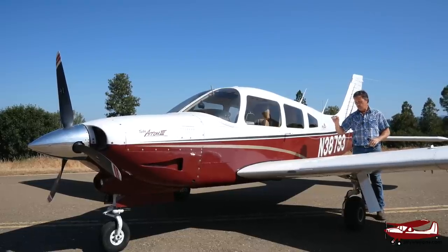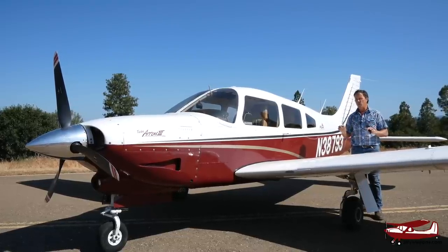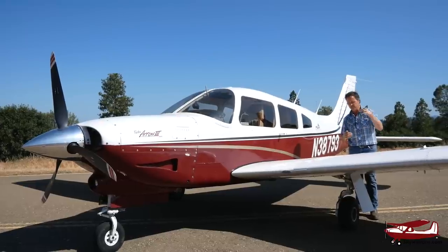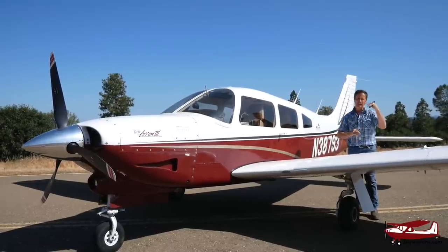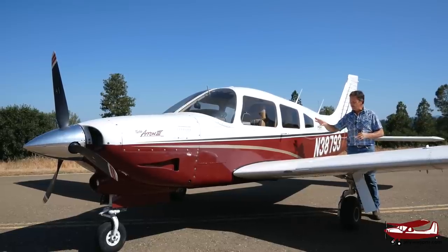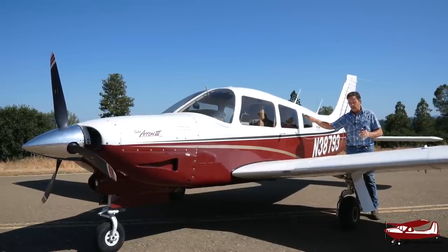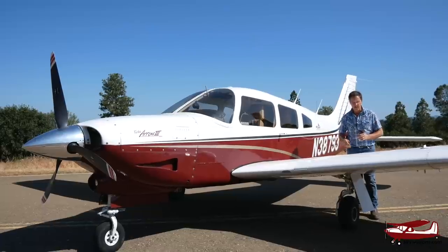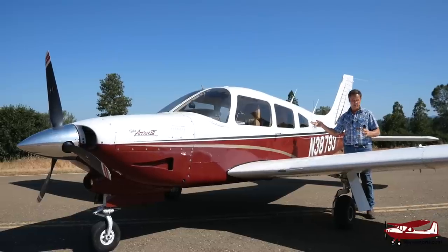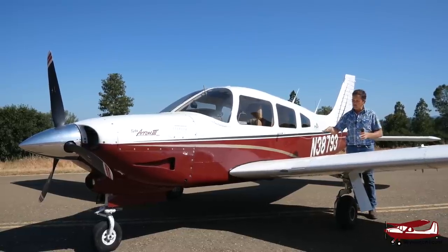But once that AD is done, you do it at 4,000 factored hours, not 4,000 hours total time. So you apply a formula that the AD gives you, where you add, subtract and multiply using the number of 100-hour inspections it's had. By the time you finish, this plane is 3,500 hours away from needing that AD, because by its factored hours it's only got like 1,300 hours on it, but it's actually got 3,000-something total time. So once you've done it, you don't have to do it again.